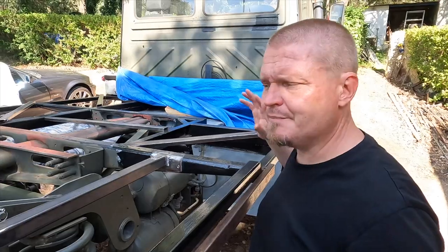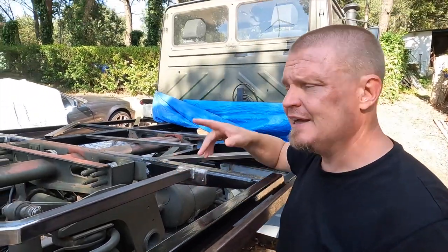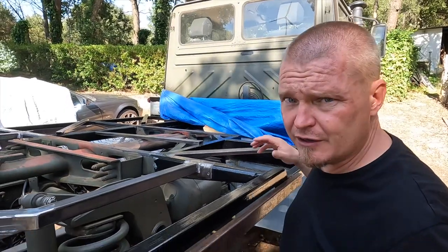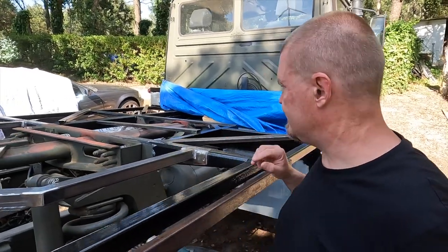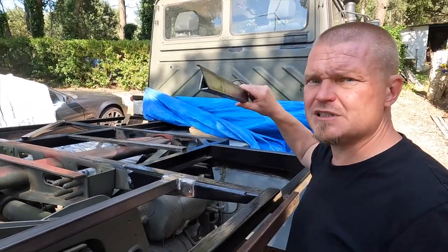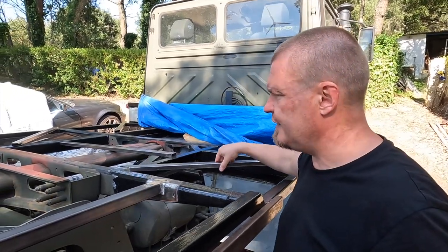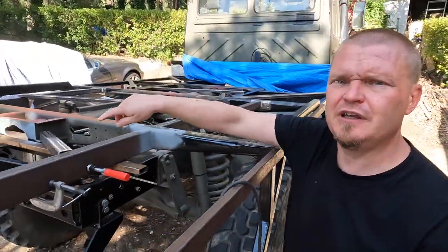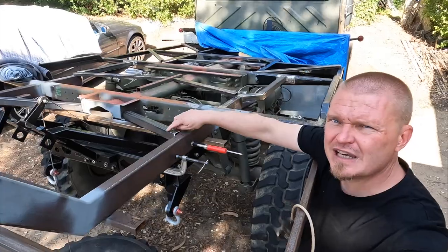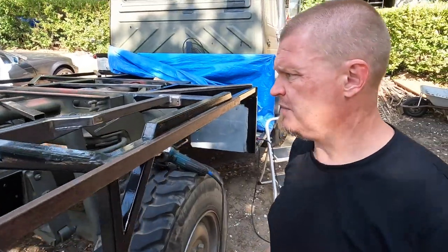With all these sticks in place, we should now be in a position where there aren't huge spans and everything should be fairly well triangulated, which means that hopefully we should have a fairly sturdy floor and we don't have to add more weight to it. These ones are actually not that beefy, so we're not adding very much weight at all. The only beefy-ish ones are the ones here at the back. They are the 40 by 40 by 3.